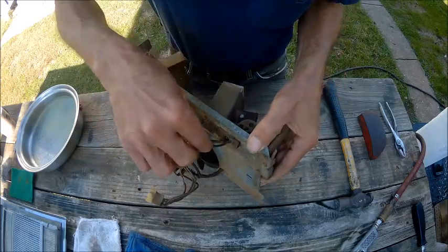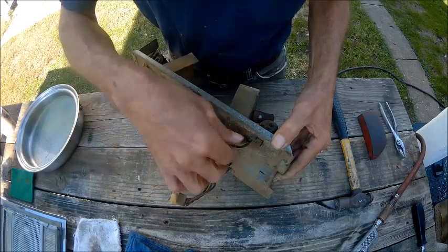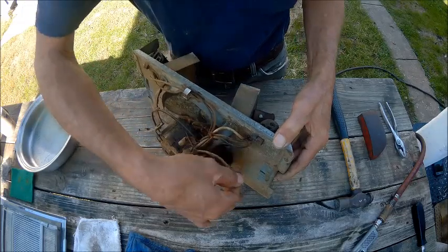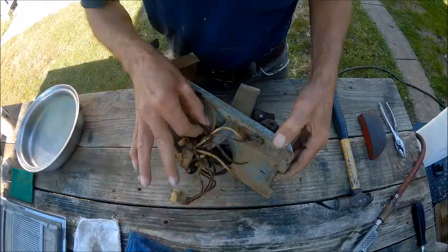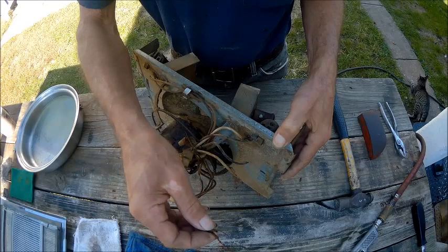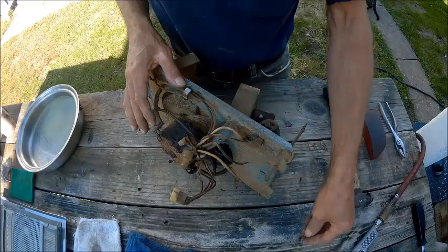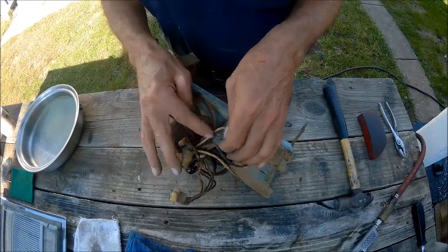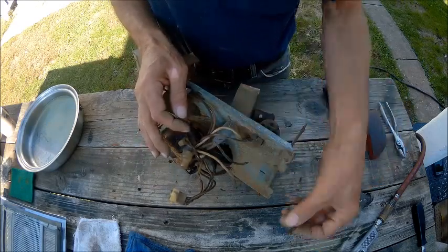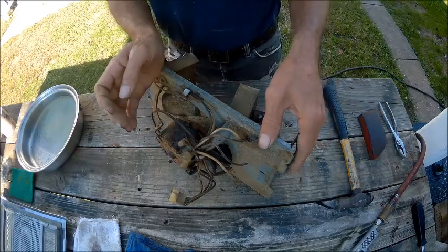See, we've got a broken wire here, 2 of them, 3 of them. Yeah, it's a wonder this place ain't burnt to the ground. If there was electricity at that barn, I'll bet you that could have been why that barn burnt. Now look, somebody had a bread tie around it, and you never use a bread tie because it's got metal inside of it, and when the stuff rots off of it, you got metal touching your wires, and if you end up with problems in that area where that wire is cutting through that coating, you're going to end up shorting it out that way. So you always use a zip tie, something plastic, something that can't short nothing.